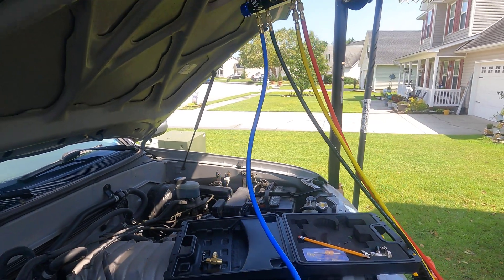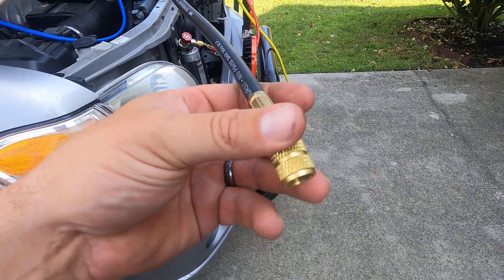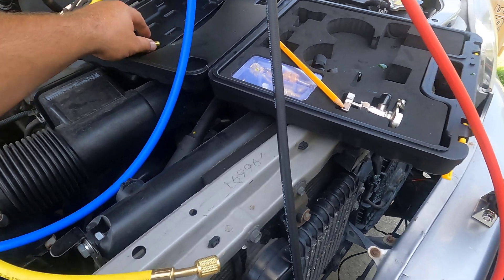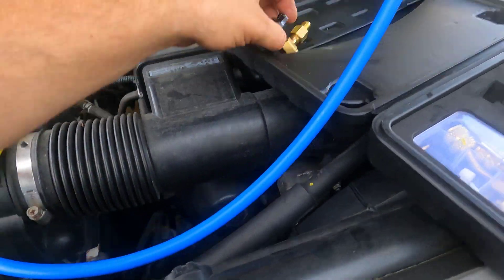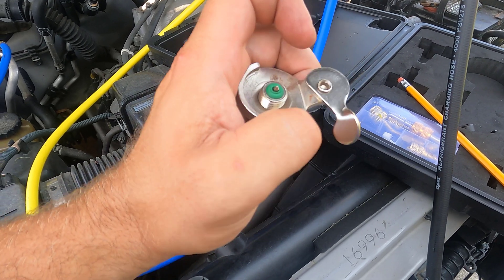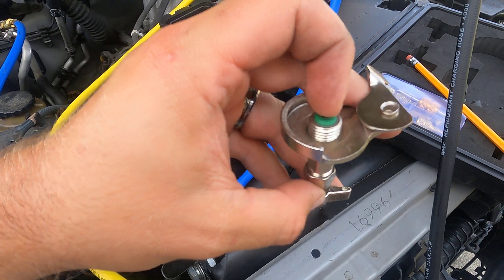As far as ease of hookup, this is very easy to set up — all you've got to do is screw the lines on and attach the fittings you want. I actually have a Harbor Freight vacuum kit that I'd just attach to this line; it plugs right in and hooks up to my air compressor in the garage so you can draw a vacuum on the line. For the charge line, it comes with various fittings. You can use the attachment that comes with the kit, or you can get one that uses the Autostore microcharge bottles. I actually recommend the latter — you put the bottle on here, cinch it down, and then screw this pin down to actuate the refrigerant.